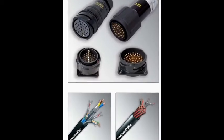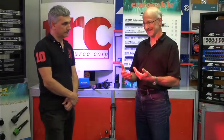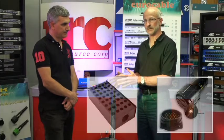That's a lot of weight in cable, and of course the stage box has a fair bit of weight in it itself. And again, unless you are particularly careful and you know what you're doing, it can be prone to damage because of that combined weight. One of the other answers to avoid that is to multi-pin terminate the stage box to the main cable or the longest or the heaviest length of cable. Means you don't have the combined weight to deal with.